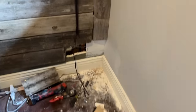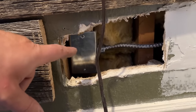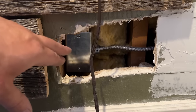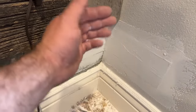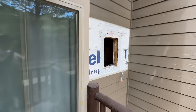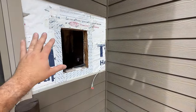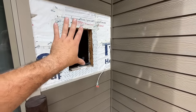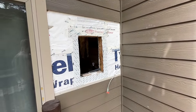We have made a huge mess here. Basically what we've done is we removed that old box, attached all of our connections — this is a dedicated outlet — and we ran MC cable. There was a stud here and a stud there; we drilled two three-quarter-inch holes and ran it through and out to the exterior. This is an HOA and they wanted us to replace all of these boards, so we're going to put new boards and paint this to match so everything looks really nice when it's done.